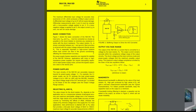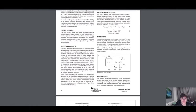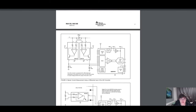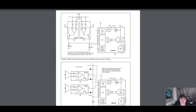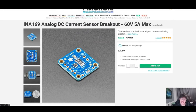I would highly recommend you read this part of the datasheet — it really helps. These datasheets typically provide a typical application circuit to get you going quickly. It's really that simple, nothing too complex. This is one of the more popular sensors, so if you just follow what it says you can easily implement it. If you're lost, these breakout modules are ready to plug in and easy to use for proof of concept, or just copy the layout from the module. The chip itself will be even less expensive, so don't worry about cost.